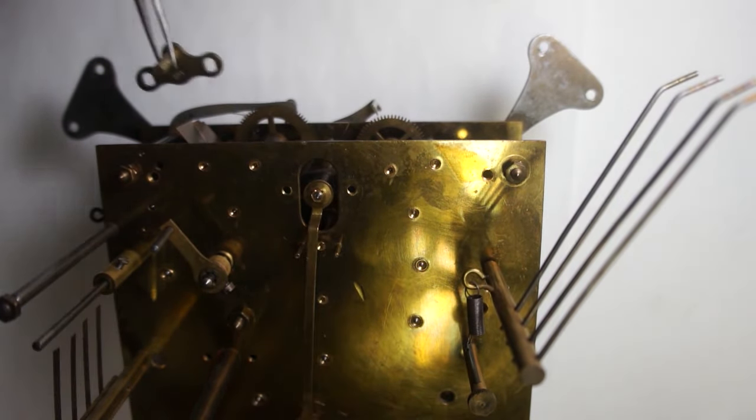So when I was taking this trim piece off, a piece of wood fell out of the top of it, and they had this piece of wood in here as a shim up there. Every place where they had the nails, there's a shim here and a shim, and a shim here and a shim here. This shim here fell. The glue came loose and fell out, so I'm going to go ahead and replace that. Get that glued up in there.